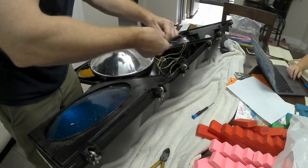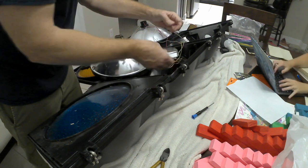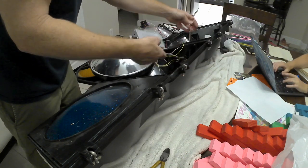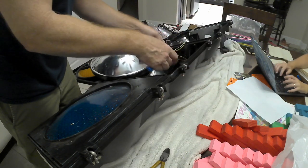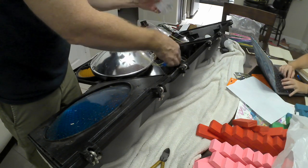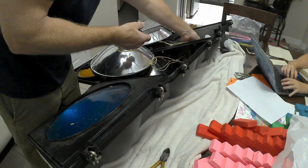If you've never used stranded wires into a screw clamp block like this, the first thing you want to do is find out which way the wire is normally twisting after you strip it, and then twist it a little bit tighter so it fits snugly in the screw clamps.